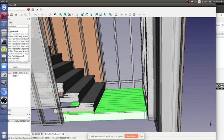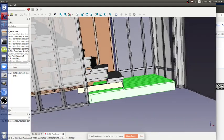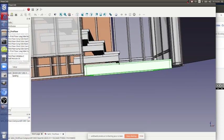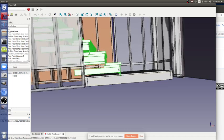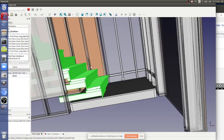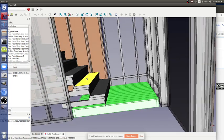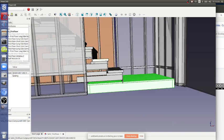We want to be clear that somehow we do trim this up. You see what's sticking out here? If we put the landing on there, the landing could serve as a support for one of these last ones, but all this stair shape here - we want to close that up. We could either do regular siding, cut a piece exactly to that, or just strip boards like that. I think that's the tractable area to match this surface here.